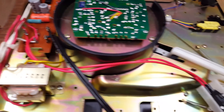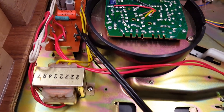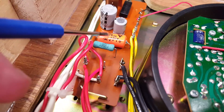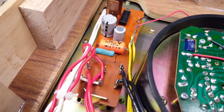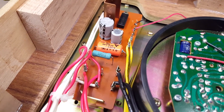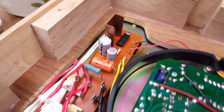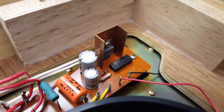There is a fairly long length of wire between the switch and the spark suppression capacitor right there. I opened up the record player to check on this, just to make sure that this is not one of those nasty Rifa brand capacitors that like to explode. But no, it's another Matsushita brand item, so that should be fine. There is the regulated power supply for the motor.